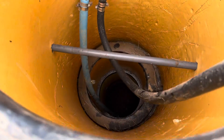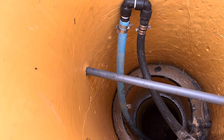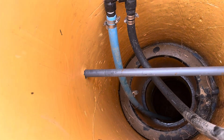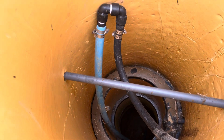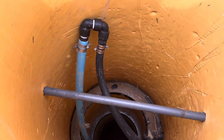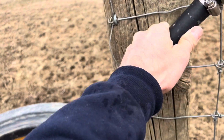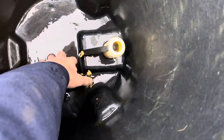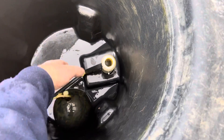Pretty simple design. We bored in water lines — that's just a one-inch line from the well. They bored in about seven or eight feet down, and then we just dug a hole here, set the pipe. This is a flexible rubber tube with a banjo coupler and a valve right there, and you just connect it at the bottom of the tank right here. It's a very simple valve with a ball. That's really all there is to it.